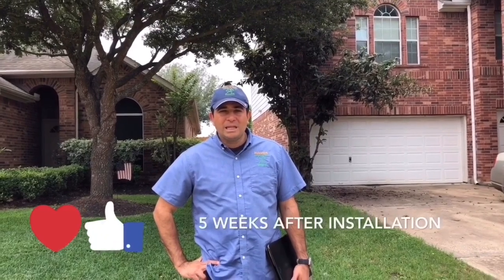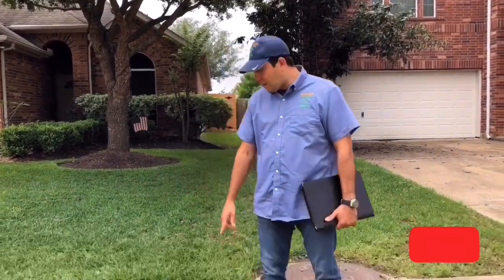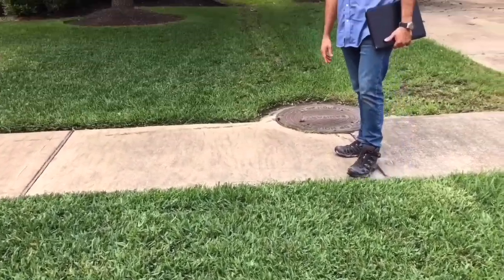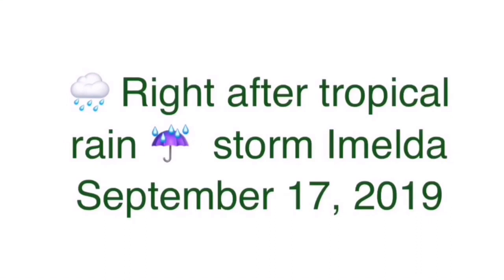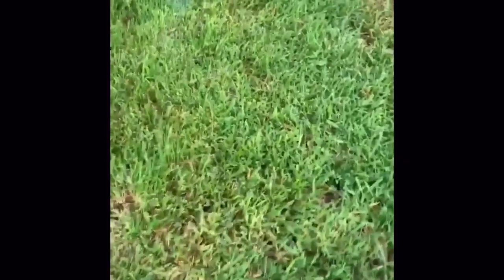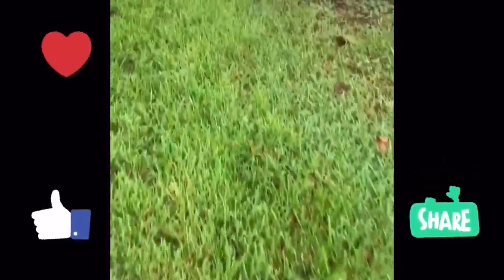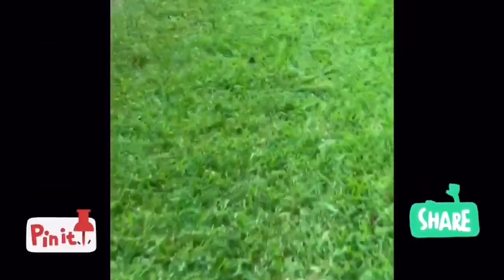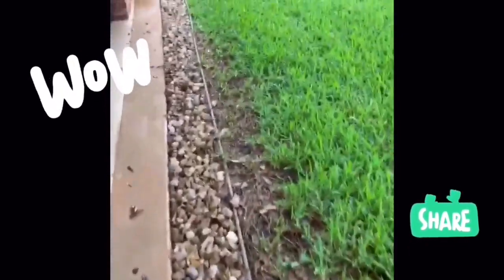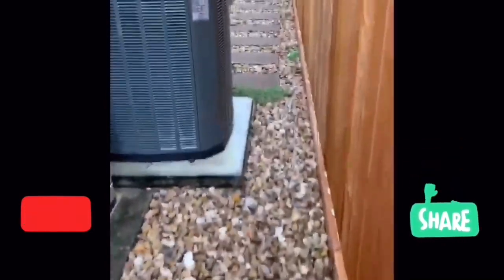We're back at this property after roughly five weeks. We had a lot of rain in the last couple of days. This video was taken from a happy customer right after Hurricane Imelda. You can clearly see there is no water standing after the big rains. This customer is very happy because he used to have a lot of water standing right by the patio and along the sides of his home. We did a French drain in combination with a 6-inch catch basin and then did some wiggle rock around the sides. It turned out to be a well done job.